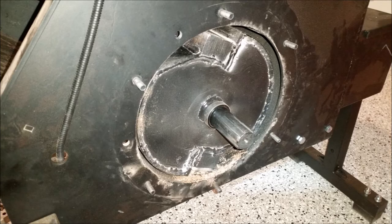And here's the side where the cover has been removed and the bearing housing. And those studs are welded in place, and all those studs are at different angles, making it very difficult, and are threaded all the way too. It makes it very difficult to remove that plate. But we're looking at the side of the actual drum, and we're about to pull the drum out and inspect it. But look at the welds on that. Pretty bad.